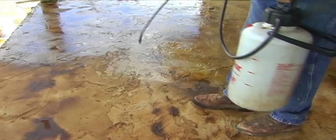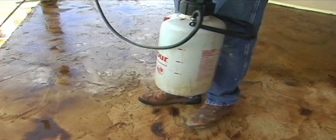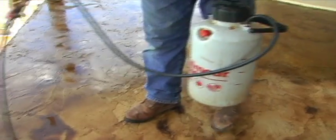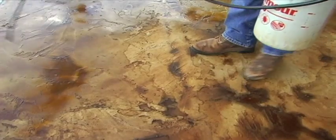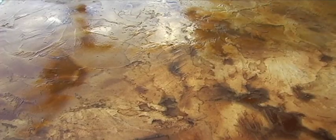Neutralize the surface with a baking soda and water solution at a ratio of 1 to 2 tablespoons of soda per gallon of water. Thoroughly saturate the surface using a bucket and/or a sprayer and scrub with a nylon brush where needed. A wet/dry shop vacuum can be used to remove the water and residue.